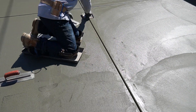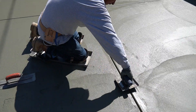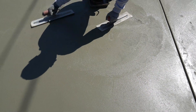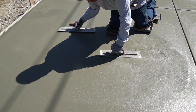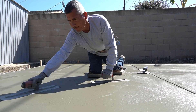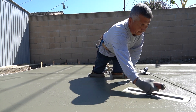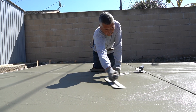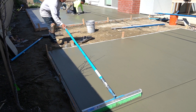Out here there's no freezing, no cold — you don't need to put stone in for water drainage like in other states. Another nice thing is you don't have to dig down; if the soil is good, 90% of the time you can just compact it and pour right on top. This particular one was a little too clay — I didn't like what I was seeing — and that's why I brought the road base in.